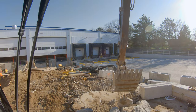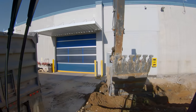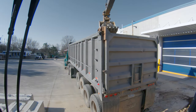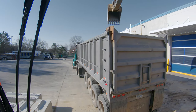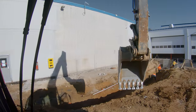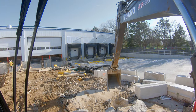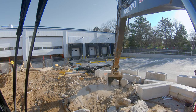You don't want a big chunk of concrete falling off and hitting the side of the truck, or damaging the existing concrete nearby. Everything over here to the left that the truck is sitting on is remaining concrete we're not cutting out - if we get a huge slab that falls and chips that concrete, we're responsible for the tear-out and replacement. A chunk could also hit the side of the truck and damage it, so make sure you've got everything in your bucket before you swing anywhere.